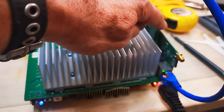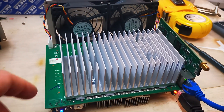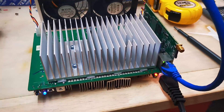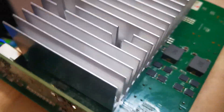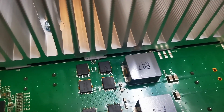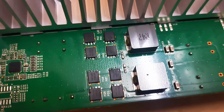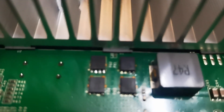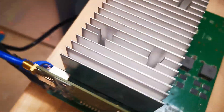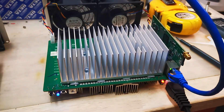So this was a previously working good controller board, so it's almost certain that this hash board is faulty. Given those capacitors on there, that is potentially what the issue is. But I also noticed the soldering on some of the MOSFETs down there is not very good, whereas it's better on the other unit. So it looks like maybe some capacitors have failed on that board, and it's definitely the hash board confirmed.